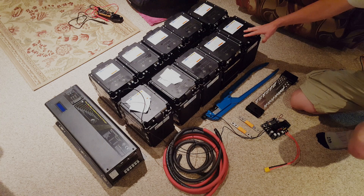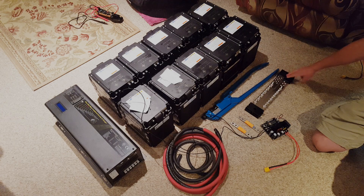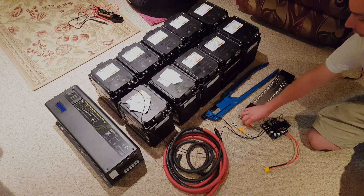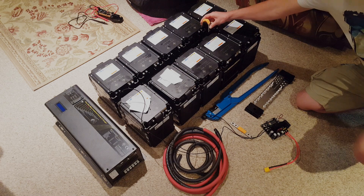We're going to go big on everything. Everything is going to be more than it needs to be, but it works out because that's safer. Down here we have a 1000 amp continuous bus bar. These were on sale at Dell City Electrical Supply — normally $205, on sale for $56. For our serial connections, we're going to use these braided wires that came out of the module when I did the disassembly. They're flexible, so we'll just be folding these over and doing our connections like this.